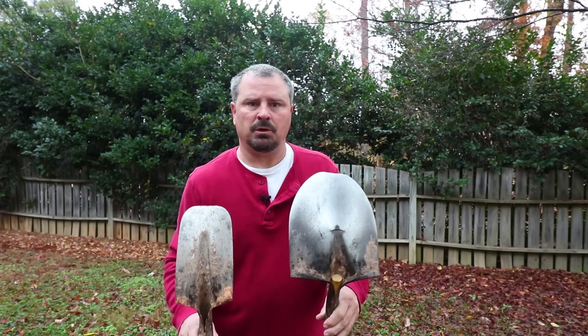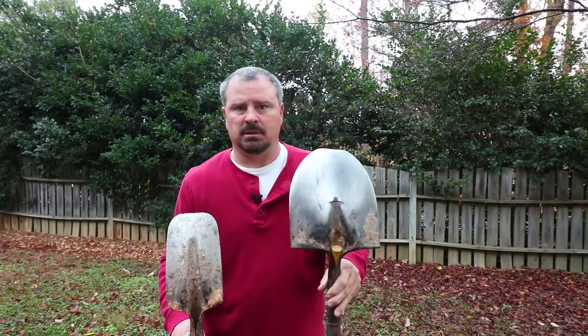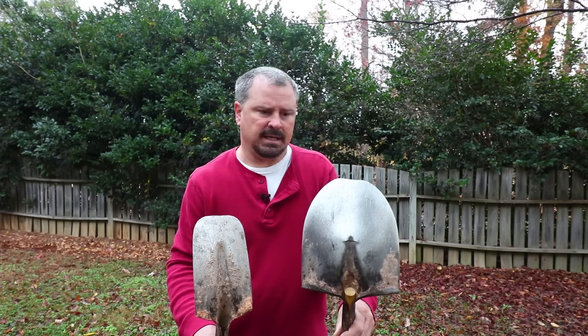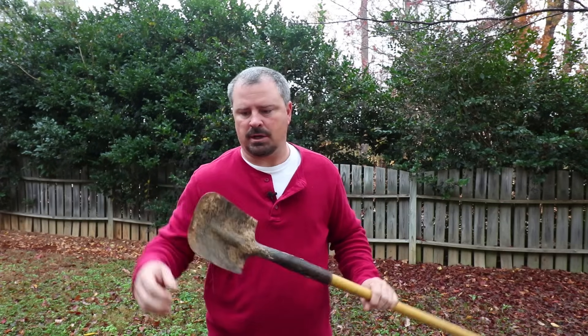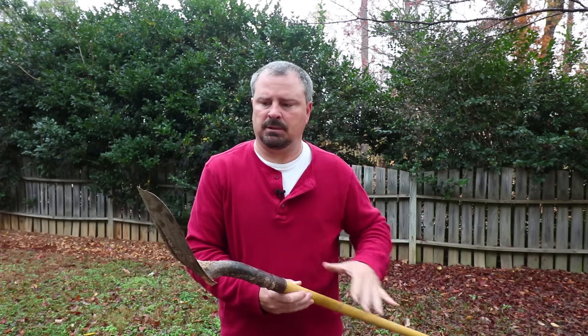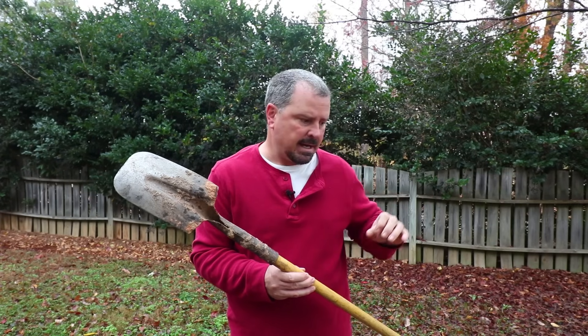Next up is the shovel — used to remove soil from the hole after the pickaxe breaks it up. I don't try to use a full-size shovel in clay-based soils; it's just very difficult and discouraging. Especially around Raleigh or central North Carolina where there's a lot of clay, you just can't push a full spade in readily. What we actually use is a trenching shovel — about 5 inches wide and 12 inches long. Once you use the pickaxe to break the soil up, this tool slides right in. If you're only buying one shovel for clay, buy a trenching shovel, not a regular digging spade.